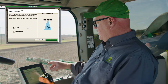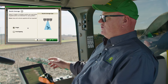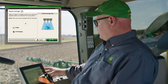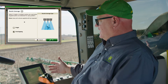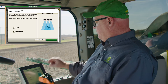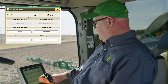Single nozzle mode works well when you're chasing small weeds where coverage is not as critical, and when you're trying to reduce the amount of chemical you're using. When we pick overlapping, one weed always triggers a set of three nozzles, making that box wider. If you're worried about coverage or if your boom is unstable — say you're in rough country and it's bouncing around — we recommend overlapping mode. It gives better coverage but will also mean you use more chemical.